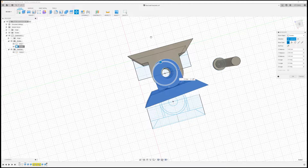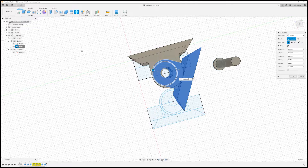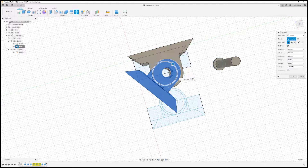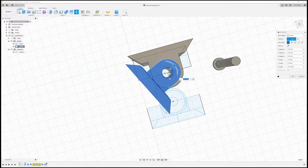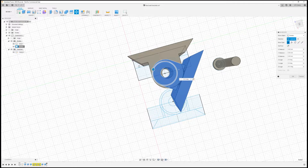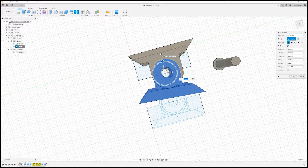I've got 65 degrees of swivel either side, so that's 130 degrees total — a little more than I predicted. Realistically though, you're not going to get the full 130 degrees because whatever you mount to this is going to interact with the wall. Picture a home theatre speaker that might be 80 or 90mm wide — that's going to overhang. You could overcome that by making this bracket a bit wider to extend the surface out, but realistically you're probably getting more like 90 degrees of usable swivel. Nonetheless, it is a swivel bracket as promised. Let's jump over to the 3D printer and see what this looks like.